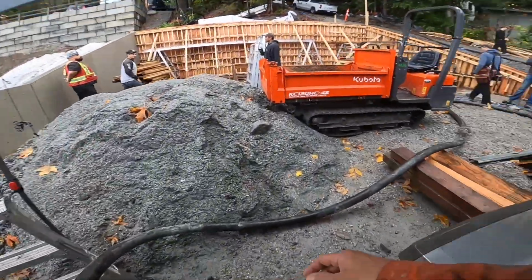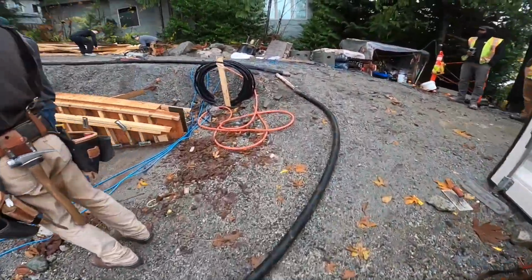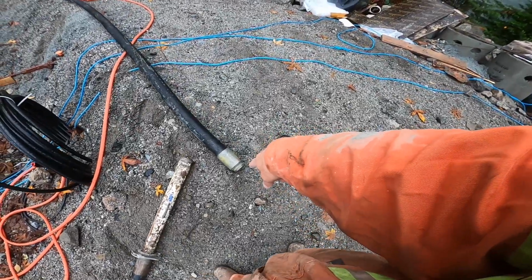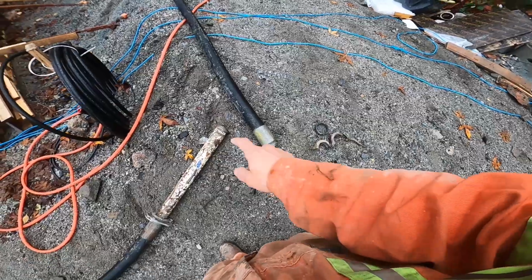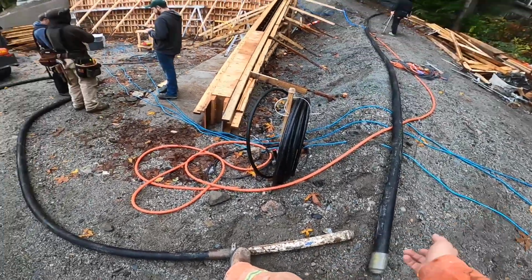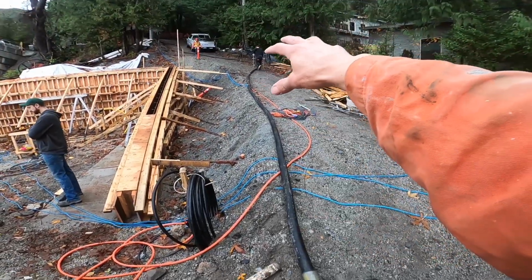So there's 2 ways to do this. We could prime separately and first prime out just through the 2.5 inch hose, run our primer through, get the first bit of rocky material through, then connect up to the 2.5 to 2 inch reducer, throw a little bit of primer in there and go the rest of the way. Today we're going to connect everything up and try and go for the full run.